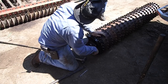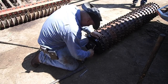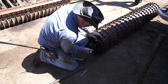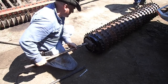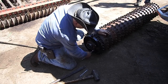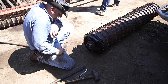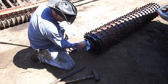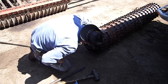So I left that insert in there after it cooled off, and that was perfect because when it cooled off it snugged down good and tight against that bushing. Now, I don't think it's going to last, but like I say later in this video, I'm not going to be using this thing very much — it's just going to be let's get this 25 acres done today. I did order the new pipe, and when that comes in I'm going to take this one back. What I'm doing here is putting the tightener clamp on — that clamp fit perfect over top of the new bushing and the end of the pipe, and I made that thing super tight so it should hold that bushing solid against the pipe so it doesn't move.